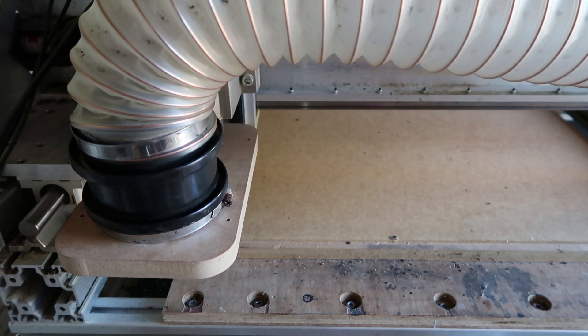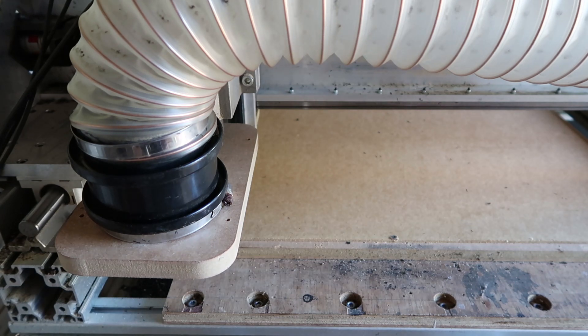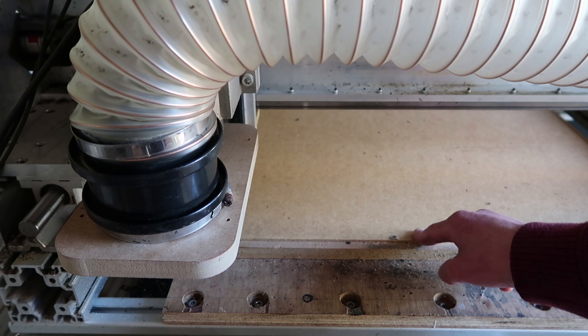And two if I want to test push-pull and make two frames. So I'm going to make a template to line up the HPL spacers I'm going to use, so I can line it up with the metal, and later on I can put the magnet jig in and have all the magnets aligned as well as I can. I'm making the template from hardboard, which is pressed wood with some oil I guess — I think Magnepan uses this for their spacers but I don't have much luck with that, and it's also too thin for me.